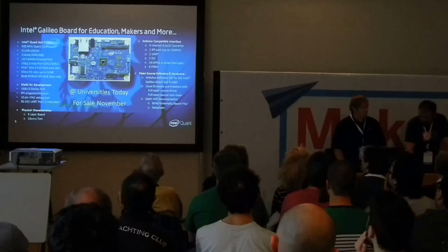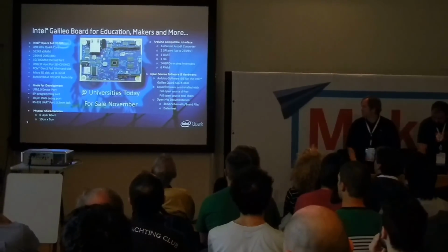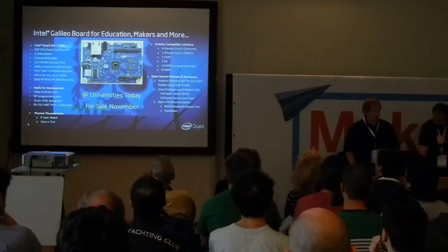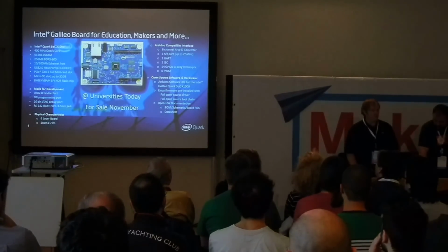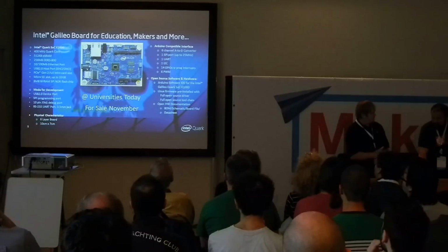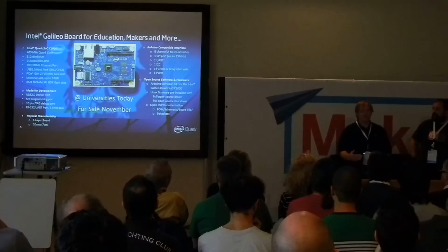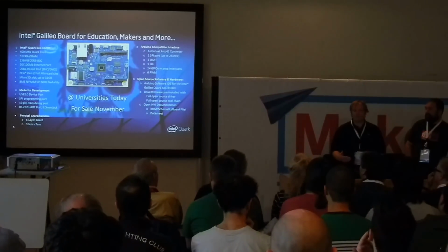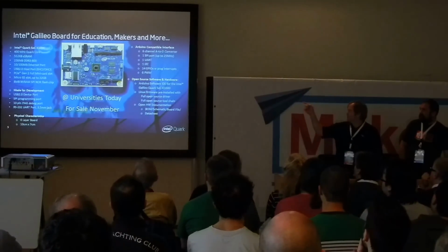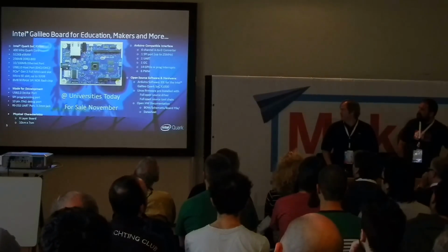This is made for the maker community for development. It is a USB 2.0 device, but that's fully programmable. Also, the SPI programming is fully programmable. From the Arduino software IDE, it automatically updates the firmware, but if you wanted to update a different firmware, you can do that through a separate SPI programming port next to the flash.